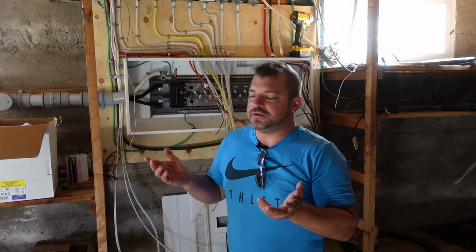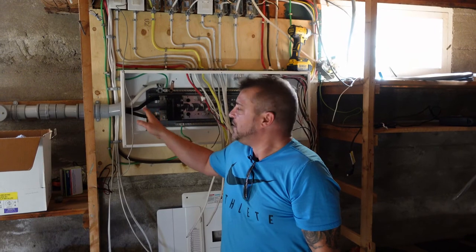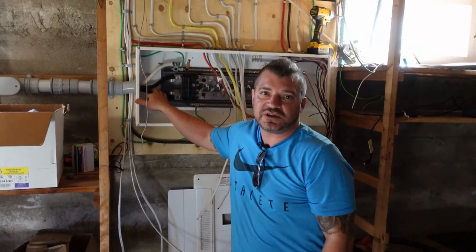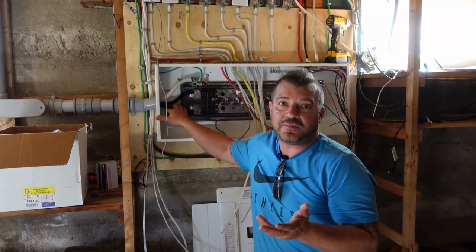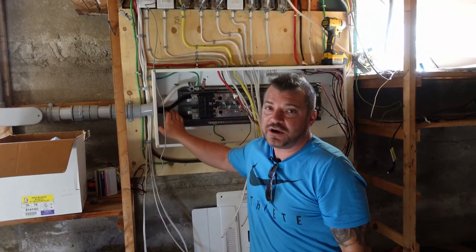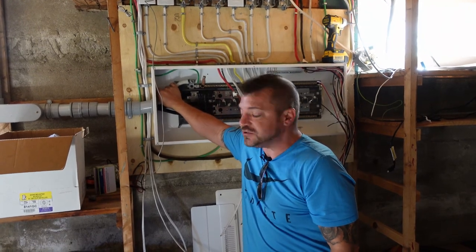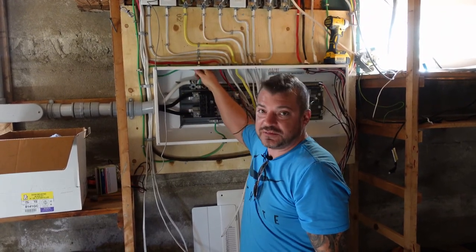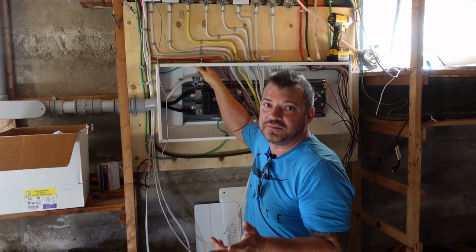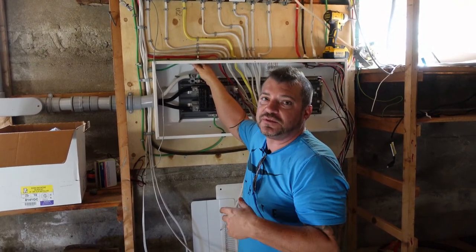The internal workings of the panel: we come in from that outside pipe and our wires connect onto our main bus bar. Because copper is so expensive, we go with aluminum. The aluminum wire size for 200 amp used to be 4-aught, but now it's 250 kcmil — or MCM, whatever you want to call it. We have our two hot wires coming in from outside the underside of the meter base, and our neutral conductor coming in as well. The additional green ground wire is number 6 copper, which goes outside to either two ground electrodes or a grounding plate.